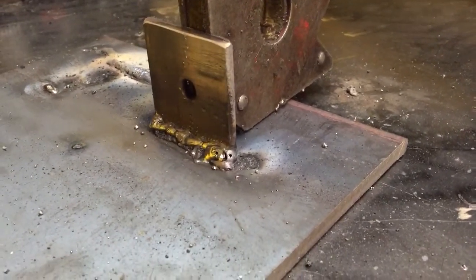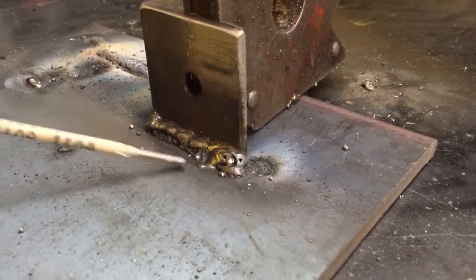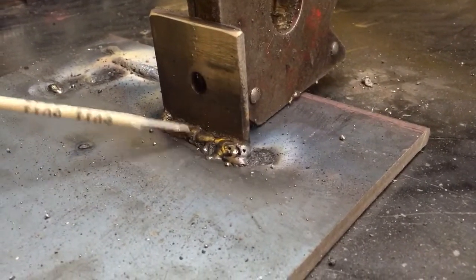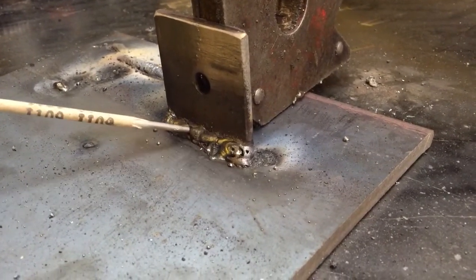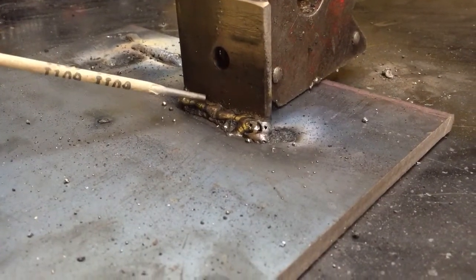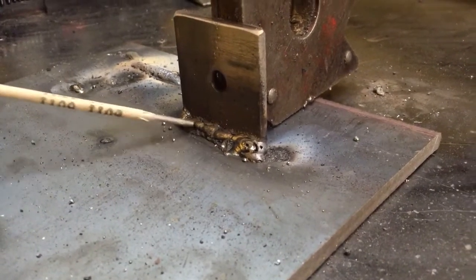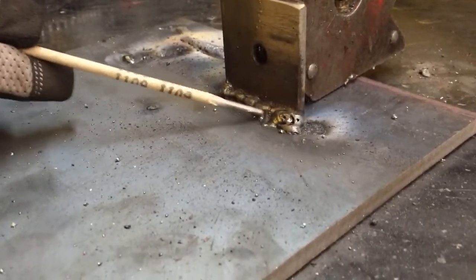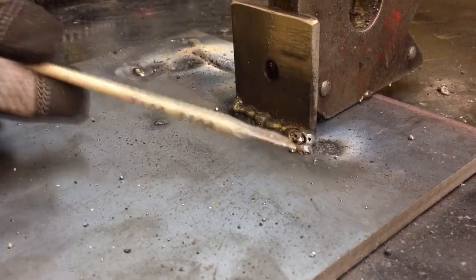These turned out okay. We can tell right now that there's still some slag down here, still some right in here in this pocket. So sandblasting might actually be a good alternative to get rid of some of this stuff. But you can see here is about halfway, and the 7014 welded more onto the base metal. And if we got rid of this, we could probably see that it's touching on here. And when we look back over here, we can see that we're getting more onto the bottom metal. So by having that amperage turned up, it was definitely a good switch.